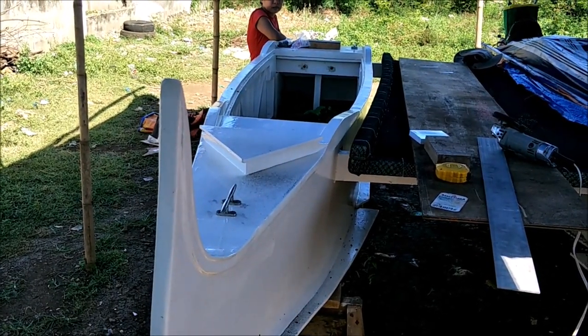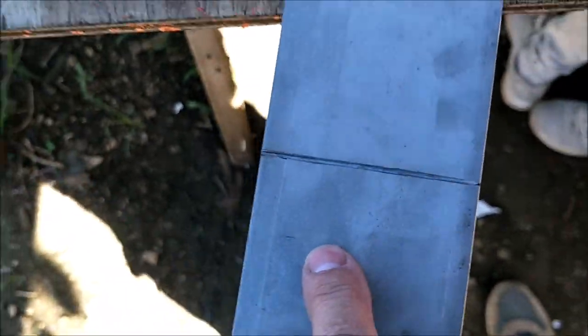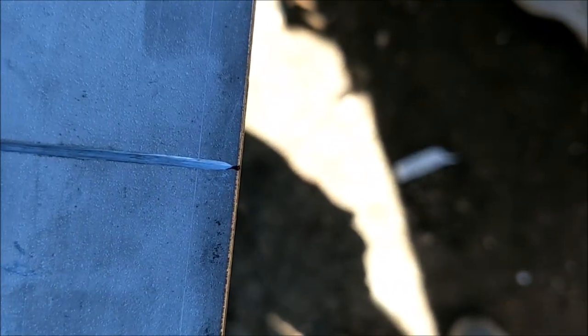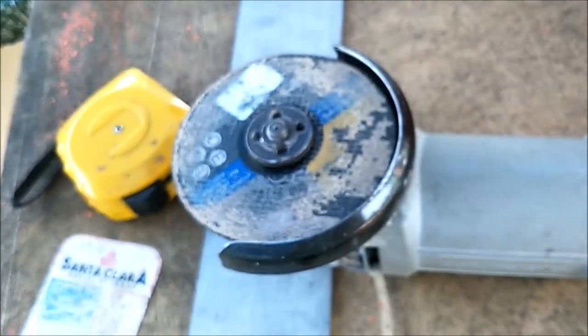If you want to know what my technique is for cutting through this flat bar — or pretty much anything — I start out by cutting a groove. I touch it and it's hot, but I cut a groove just to get my line straight. I don't cut all the way through in one pass because you'll be fighting it — it'll be twisting, it'll be breaking your blade, and you don't want that blade to break.